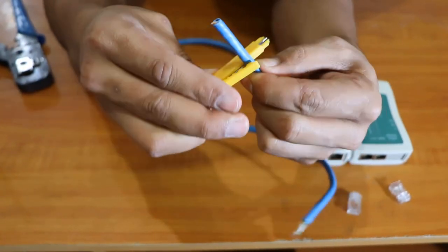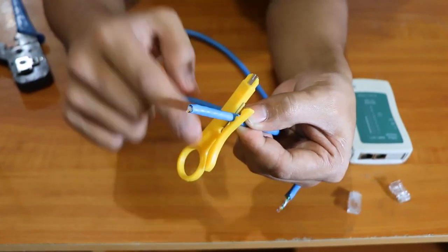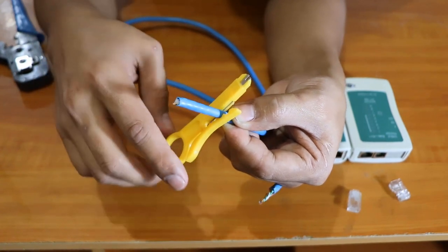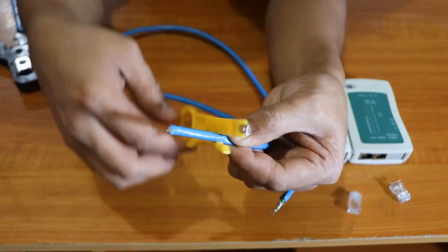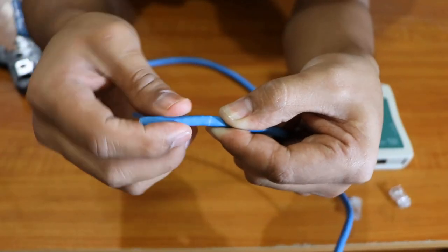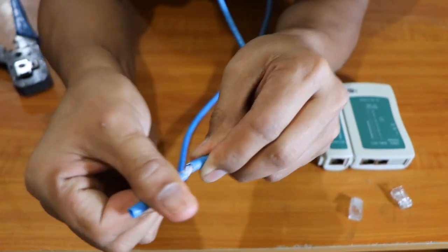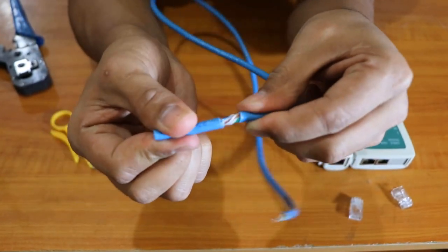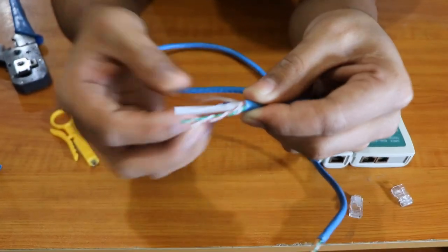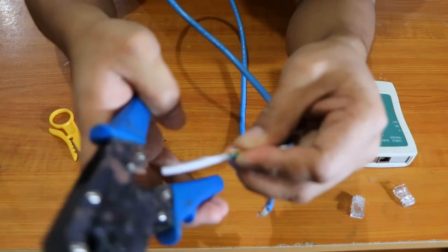Let's say about one inch. The goal of the wire stripper is to cut through here and make sure not to damage the eight wires inside. We're just going to do it like that — then look at this, you can see it. Just bend this one and you can see it will be removed. Twist like that and pull it, and there you go — your eight wires for the UTP are out.